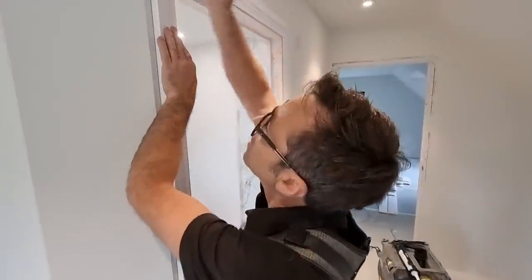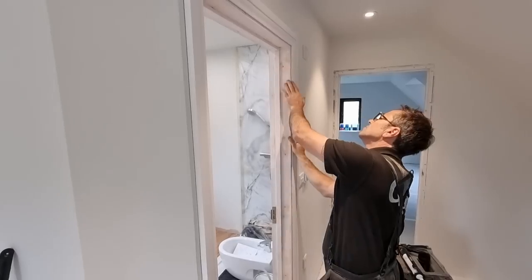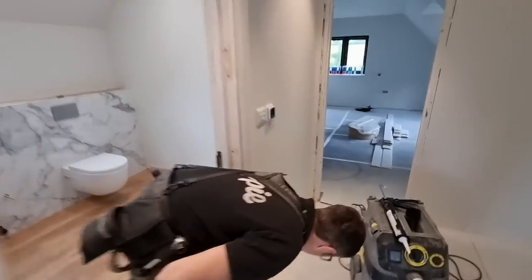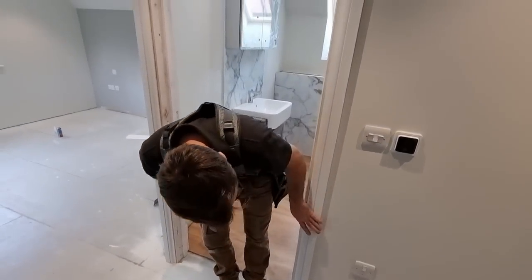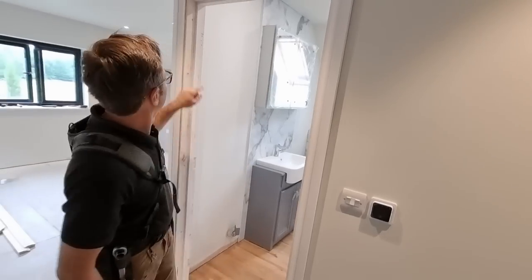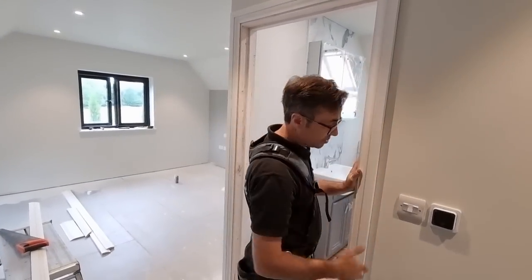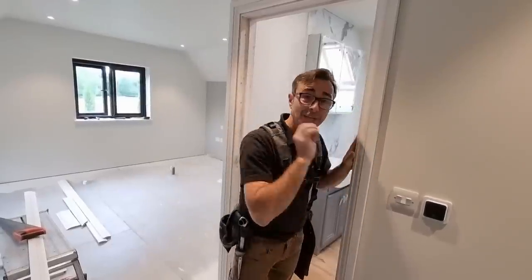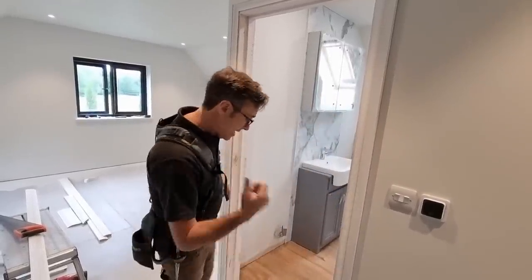And that's what I like about the adhesive, because it's on and it's held, and I can actually just literally pull it in and out to where I want it there, and that adhesive has grabbed it and it's holding it. Okay, so you want to be parallel, obviously, to your lining everywhere, which is the name of the game. You also want to be straight from top to bottom. If you're really anal, you could put a straight edge against there, but providing your linings are nice and plumb and true, just keep it parallel and pin them in.